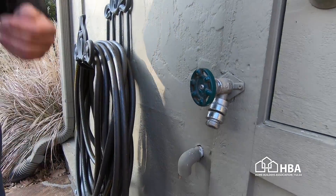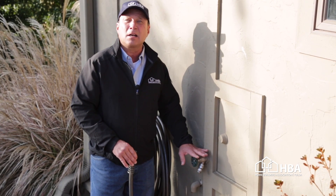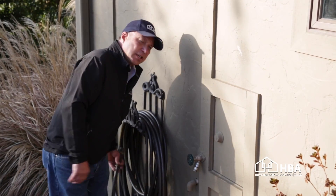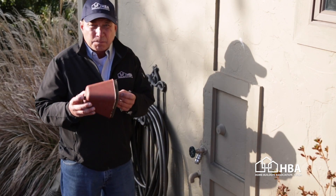With the nature of water, your hose holds water. When water freezes it expands, and it can expand back into the faucet and break your water line. I promise you the last thing that you want is a broken water line in the middle of winter. So after disconnecting the hose from the faucet, I recommend going to one of your box stores and getting a faucet protector.